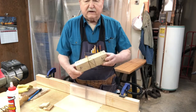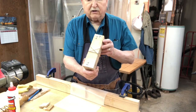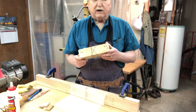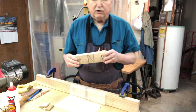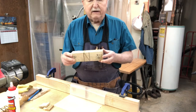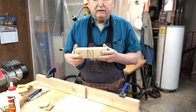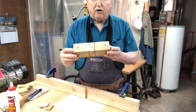This is the initial block. It has four sides, obviously. I have cleverly numbered the sides one through four, with a little arrow at the top on one end. To make a Celtic Knot, you need a piece that's relatively square, about six to eight inches in length, depending on the project. You need to make an angle cut across each of the four sides and glue a contrasting piece of material in there, then wait for the glue to dry, trim off the excess, and eventually you'll have a cut through all four sides.